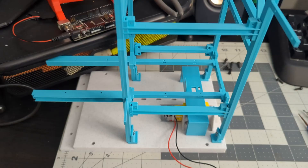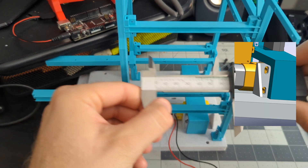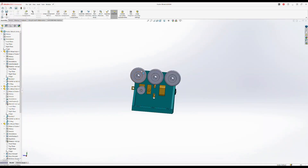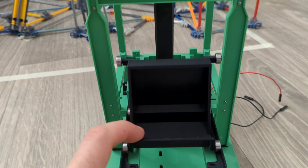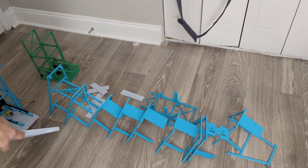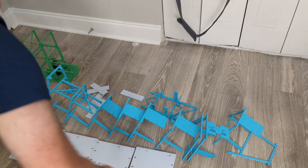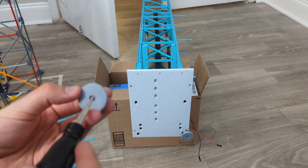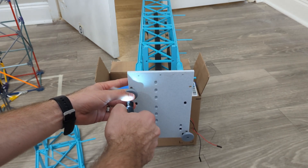The lift motor mounts to the base plate of the ride. To tension the belt, I added slots into the motor mount to give me room to pull tension on it. To move the cabins into the station-ready area and into the lift, I created a kicker wheel assembly — a simple printed wheel with an O-ring to provide grip. These mount to a printed base containing another motor, and I tie the motors to the wheels using another O-ring as a belt. I built a prototype and they work well, but I expect the O-rings will eventually wear out. The base of the ride combines with a series of other smaller bases along the length of the model, printed from a marble PETG to give a faux concrete look. The color didn't quite come out the way I was hoping, but I spent a lot of money on PETG so I'm just going to roll with it.